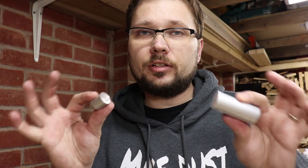Right then, it's time now to take care of the larger dogs for our workbench. So you've got one smaller piece of 20mm that will go into your bench, and the larger one will stick out on top. Now, how are we going to connect them together? I've marked the middle of both of those. I'm going to be using my pillar drill to drill through this one.